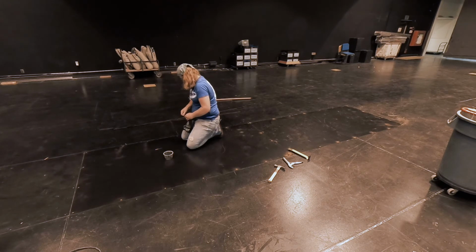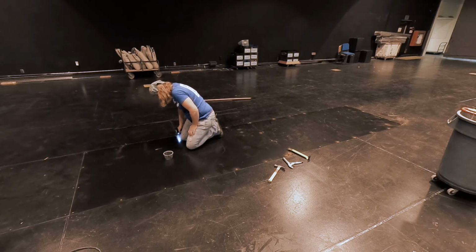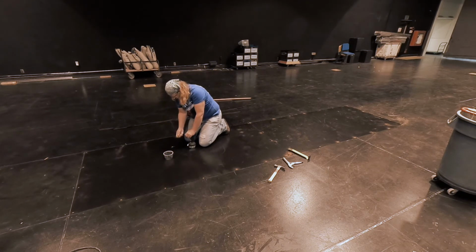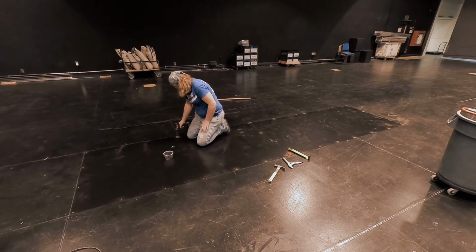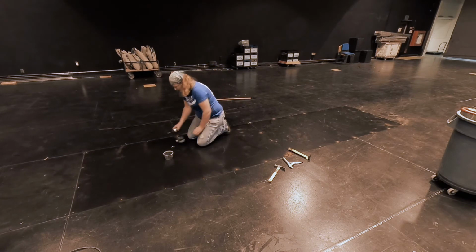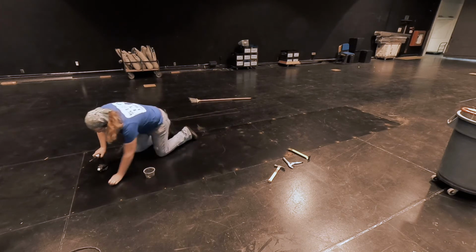Going in. What you will do with a theater as old as this one, with as many layers of masonite placed down, if we were to re-masonite the whole thing, we might want to offset them so they go on in a different pattern to avoid that problem. And you'll also experience frequently, just randomly, and it happens all too often, where I screw a piece of masonite down and I hit the head of the screw in a plywood lid. You would think the chances of that are none or virtually none, but they happen quite frequently.